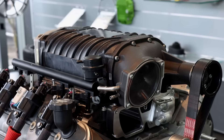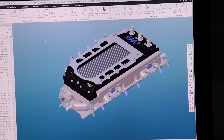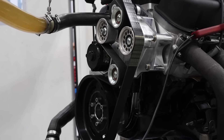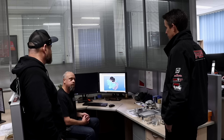Justin can then start to look at how our supercharged manifold assembly — which is intercooled — needs to integrate both from a cylinder head and also drive system perspective. In the case of the Big Block Chev, it's got a fairly narrow valley compared to what we're used to. The LS stuff is fairly wide and the bolts go straight down in the cylinder heads, which leaves a lot of room for an intercooler core. Big Block Chev, we don't have that luxury. So we've got a 10PK drive with the biggest crank pulley we could fit, which is 245mm in diameter.